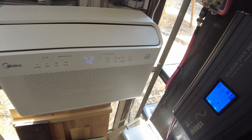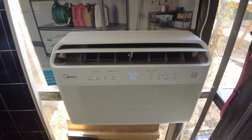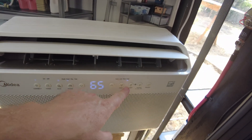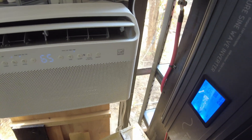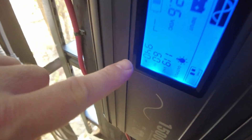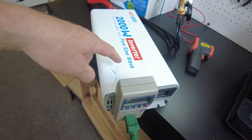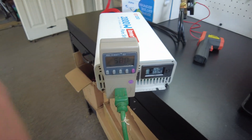This Leaski 1500-watt inverter has been running this AC on max for about 10 minutes and it's not complaining at all — it's showing 940 watts being used. Whereas on max on the Redodo inverter we were showing over 1100 watts. This inverter can handle it; the other one doesn't quite like it.